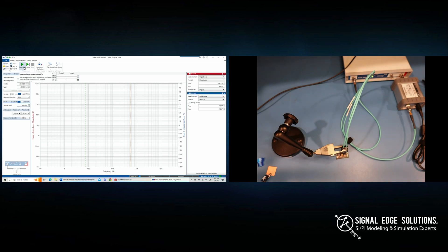I'm going to run continuous mode as a sanity check. For the open, what I expect to see is high impedance — and you can see the red trace showing high impedance as expected for the 50-ohm port setup. I'll turn off trace 2 and make the trace thicker so it's easier to read on screen.